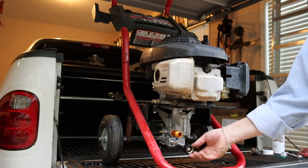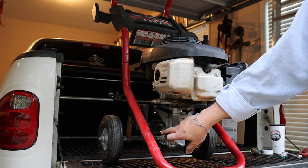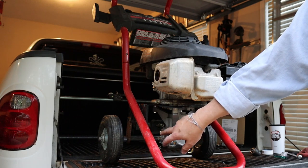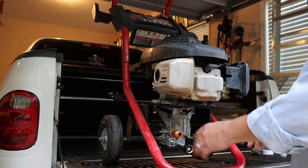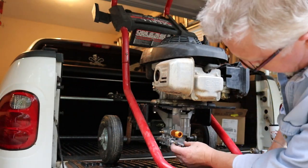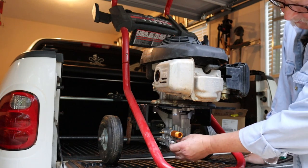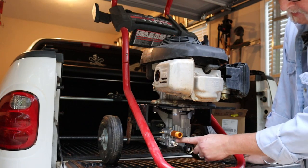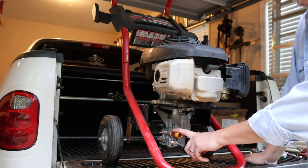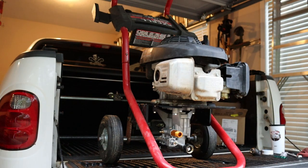I've got good access to the hose and the wand. And here's your detergent uptake — so if you're using bleach or detergent or something like that, that's where you stick your hose. So without this shroud, it's easily accessible. And it's got an unloader valve — I think that's 17 millimeter and that's 10, if I remember the instructions right — and you can change the pressure also. This comes set at 2,800 PSI, which is a little bit higher than the factory pump. The factory pump is 2,500. I'll get it all hooked up and we'll try it out.